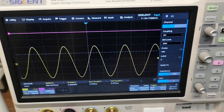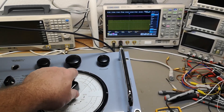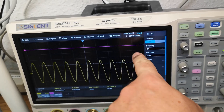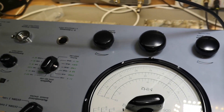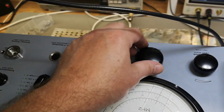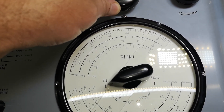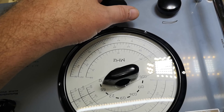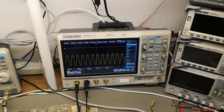Problem is solved — nice and stable output. See all the different ranges. Let's crank it all the way up. See, 10 megahertz — let's see where we are. This should be 10 megahertz and it reads nine-point-something, so it's not super accurate anymore. This should be 11, let's go all the way. Okay, so if this is 12 and it reads 13, we need to do a little bit of adjustment for this to be accurate. But anyway, it's nice and stable.